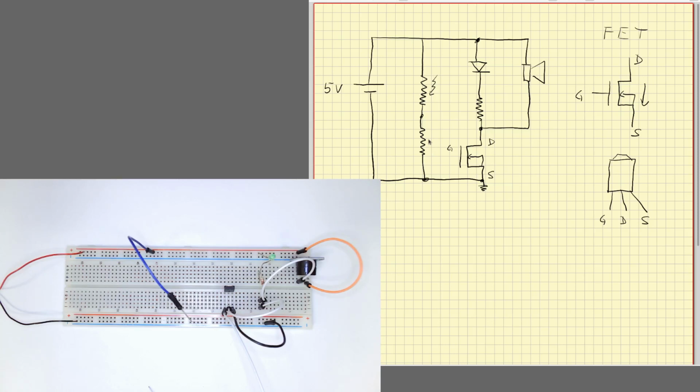Okay, so I can do it using a variable resistor, which is also called a potentiometer. Potentiometers are like this. Okay, basically they are devices which have a constant resistor but have a middle terminal, and then they have some mechanical system and a screw or something or a knob, so I can move the middle connection up or down. So I can change the resistance from this node to this node and from this node to this node. Okay, so I could use a potentiometer like this, and by moving the potentiometer I could solve my problem and also adjust the sensitivity.